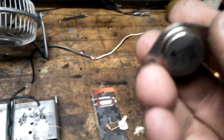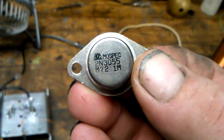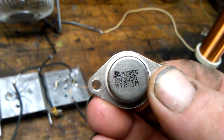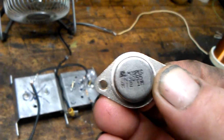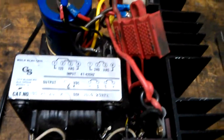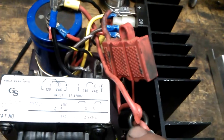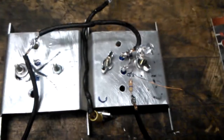These transistors are rated to roughly 60 volts at 15 amps — I've pushed it about one and a half amps before they pop. The power comes from a solar power supply I've customized myself with a 50 amp rectifier, some fuses, and a little line filter choke on the positive lead.